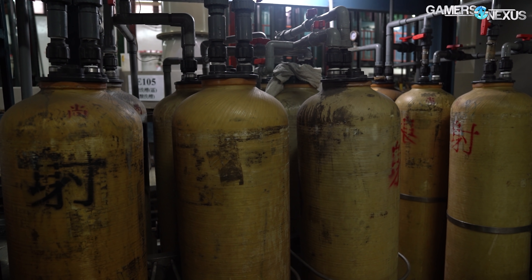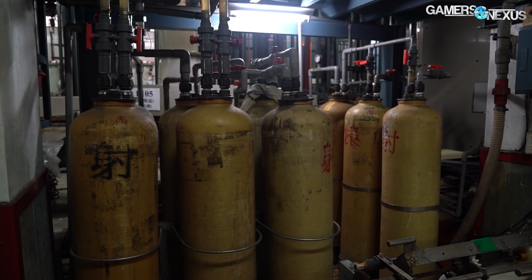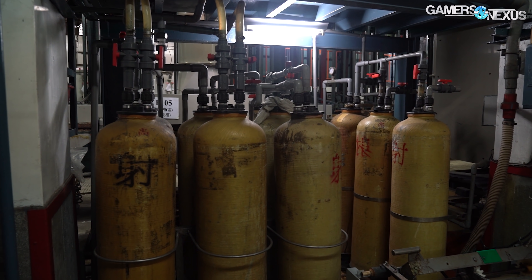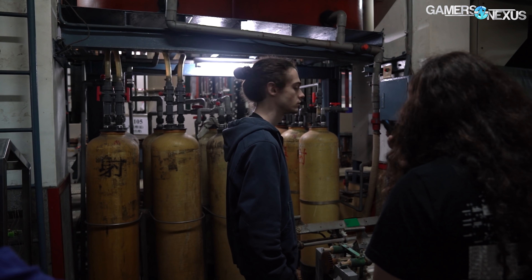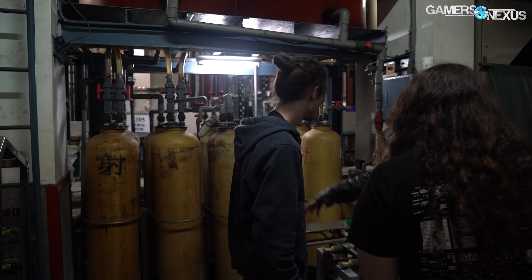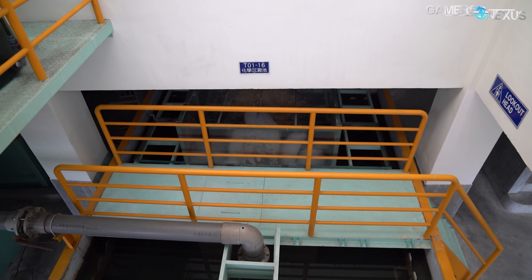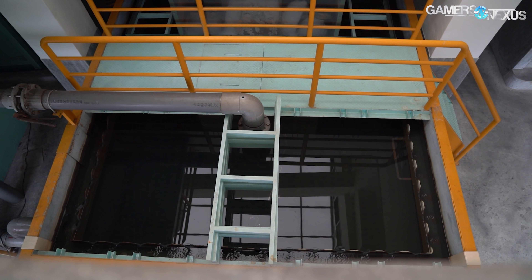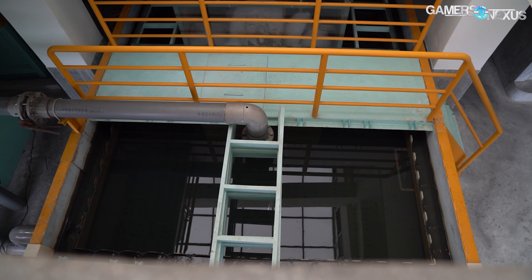There's a series of imposing tanks kept downstairs near the plating line, but these are simply used for filtering and holding the production line's water supply. The factory needs a constant supply of completely clean water and produces a constant supply of dangerously polluted water. Therefore, a large portion of the factory is set aside for filtering waste. This factory is used as a case study by the Taiwanese government because of the effort they invest in filtration. The building has multiple stories, but only the ground floor actually does electroplating — other than ovens and QA testing, the upper floors are occupied by this elaborate filtration process.